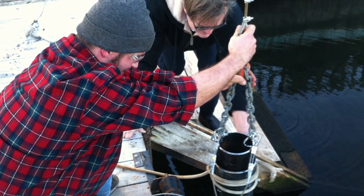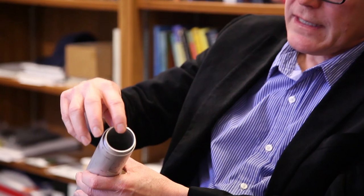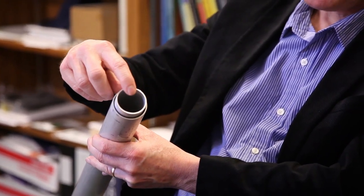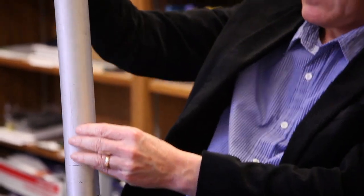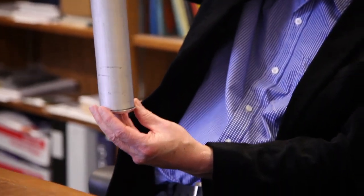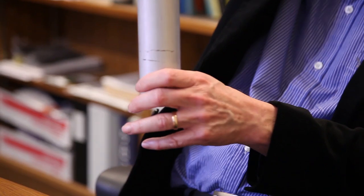To solve that, we introduced this double pile, where we inserted another pile inside the outer structural pile. We have an airspace that separates them, and these two pipes are connected at the bottom with a flexible coupling — which is really the secret sauce of our concept.